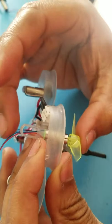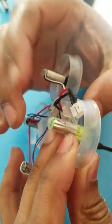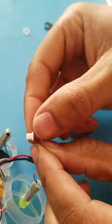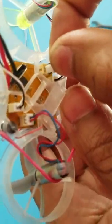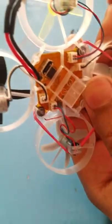So here's a new motor going in. You hold the back here and you just push so it pretty much bottoms out. A lot of people recommend that you twist the wires to actually make them shorter — so you twist them and plug it in just like this. There's a special orientation; you'll see a little tab here. You go to your board and get that tab to line up. Push it just like this, click that in, and that's an install.